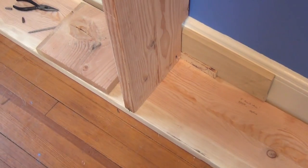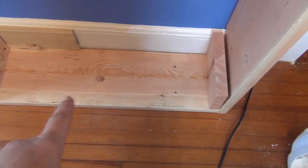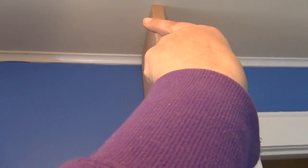So I have my middle board in. Here it is. And I just want to show you what I'm doing here. You see there's a space here between the ceiling and that board. It's basically lower right here than those two. That's because I'm getting another one of those plates, that 69 inch, and it's going to be inserted right here. So it's going to be anchored this way here, toenailed here, or you know, anchored in an angle, and same thing over there.